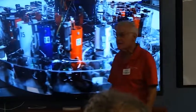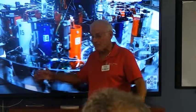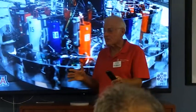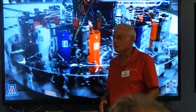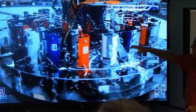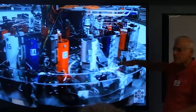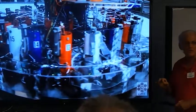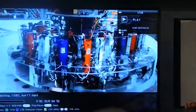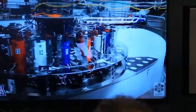And what accuracy do you achieve in a certain area? Is it 10 nanometers? Not quite 10. On a big one, 18. On a small one, the 21 footer is 14. So the technology of the lap polisher is crucial to the Mirror Lab. And when we get to it, we've also changed our grinding technology.